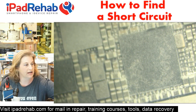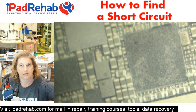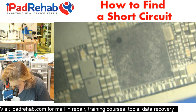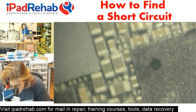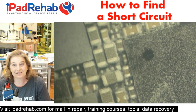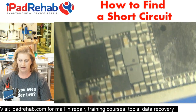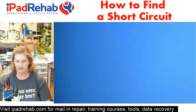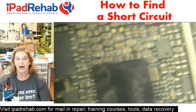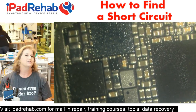All right, now I'm going to stop the DC power supply as soon as I see heat. So go. Stop. All right, look at that. Now that is precise. I mean, there's no way to argue. That is some precision. So now we know that this spot right there on the PMIC is what gets hot first. And we could freeze spray on the other side of the board where we also saw heat, or we could check up by Wi-Fi or any place else and see, does that get hot before or after the PMIC? We can really precisely localize exactly what's getting hot, and really quickly.